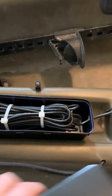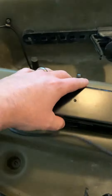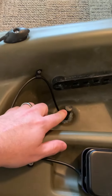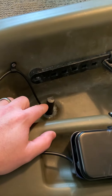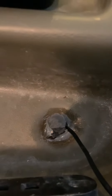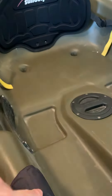I'm eventually also going to seal these holes so water just can't be sitting inside this thing. I ran the transducer wire straight out the back, secured it with a couple of the little clips that come with the Garmin. Down inside, I used a wooden dowel — a lot of people had different ideas about how to mount the transducer, but I used a wooden dowel, cut it to fit, and notched it so my cord actually sits in line with the dowel. I used silicone around the hole. I have my other two scupper plugs in the back siliconed up so water doesn't come underneath.